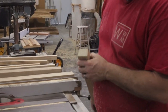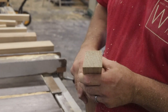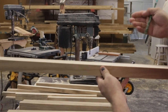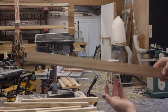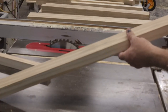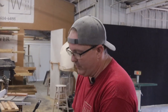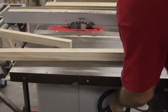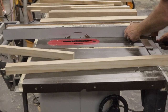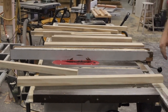See that angle? The thing about a meeting rail on a bottom sash is when you look at it — I'm going to turn it the way it sits — the angle is going to face away from us. There's going to be a molded edge right there, and the glass is going to come up into a groove. I'm going to cut that groove right now. It's going to be cut at seven-eighths from the inside face. I'll lower my saw blade and set it at seven-eighths.